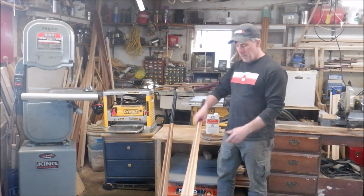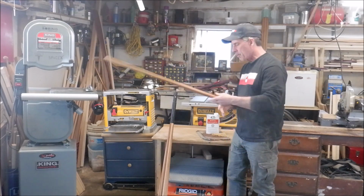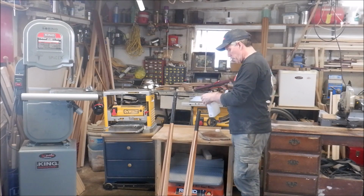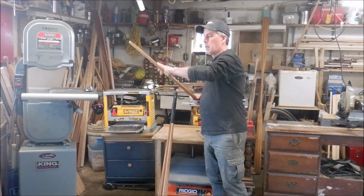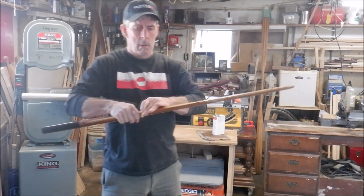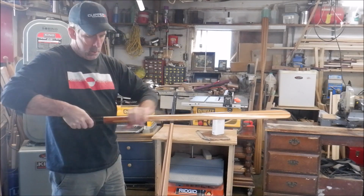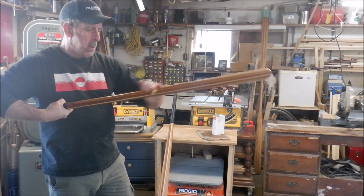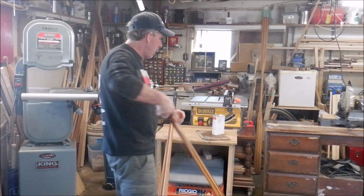Hey YouTube, Joe here. Just putting a final coat of oil on one of our 2-piece Greenland paddles here. This one's shipping out this week. So here we go. We got our 100% pure tung oil. And get a little bit on our cloth here. And just start rubbing it in. Bring this over a little closer for you. Try and get a good angle. This is the 4th coat of oil for this paddle. Get the oil on, and we're going to set her aside for about 15 minutes, and then rub it off with a clean, dry cloth.